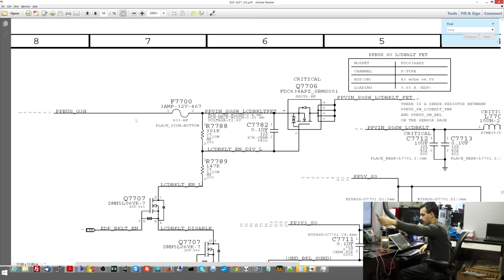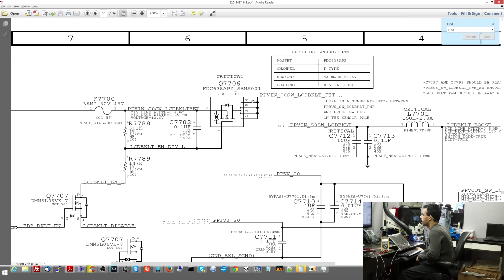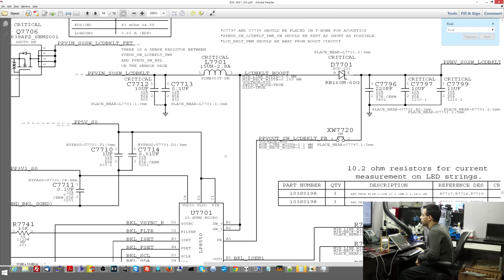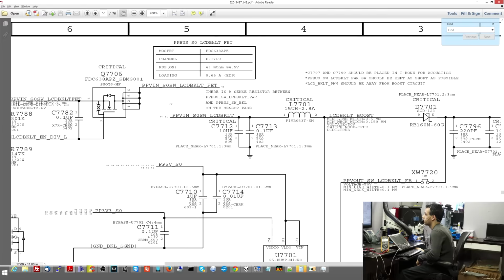If I have output zero, it could mean a couple of different things. It could mean that I have a short to ground for some reason. It could be that power is not flowing through this transistor after the fuse. It could be that there's a blown via or corroded trace. So let's just continue on and see what we get.